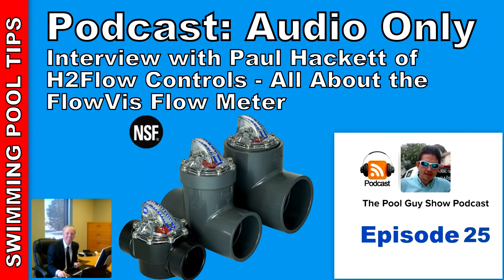It's a flow meter that incorporates a check valve — that makes it two products in one. It has an easy-to-read scale that also provides an indication of velocity. It can be installed in any attitude: horizontal, vertical up, vertical down, even upside down. It was the first flow meter to be NSF 50 certified and remains the only NSF 50 Level 1 flow meter on the market today. Under NSF 50 there are five levels of accuracy, with Level 1 being the highest achievable, and FlowVis is the only one that has ever achieved Level 1 — even when installed right in between two 90-degree elbows.